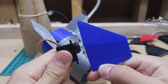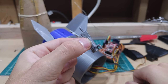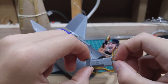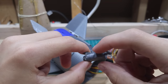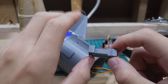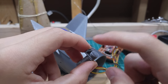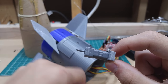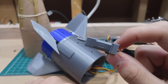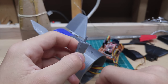For the redesign, I'm going to have to go with gear motors. This is a one-to-one printed representative scale model. These are available on Pololu for about $16 a piece, or cheaper off the usual Chinese sites. These come with a built-in encoder and header, which is great since encoders are more precise than potentiometers. However, they come with the caveat of having relative positional control, not absolute like potentiometers.